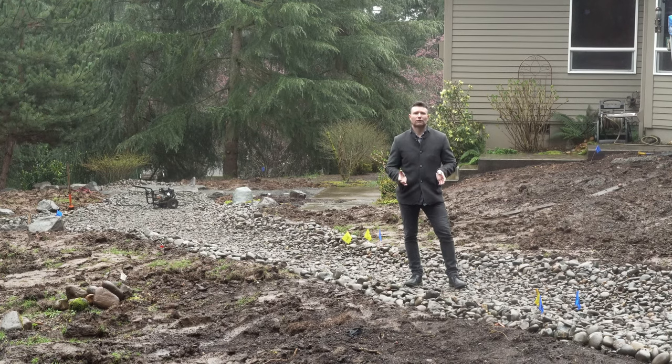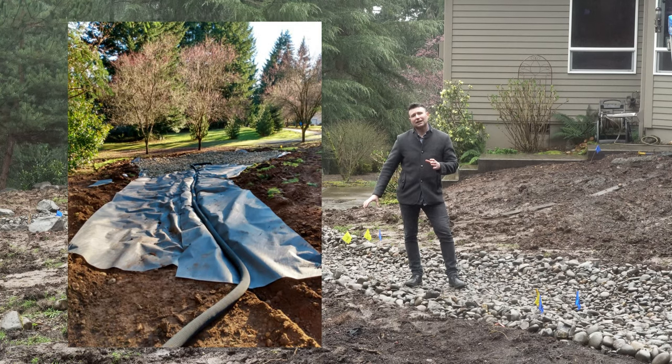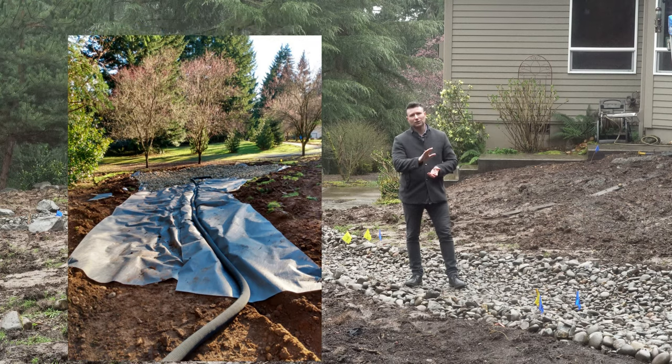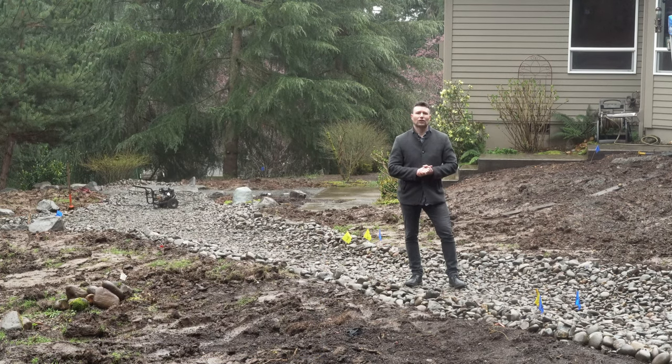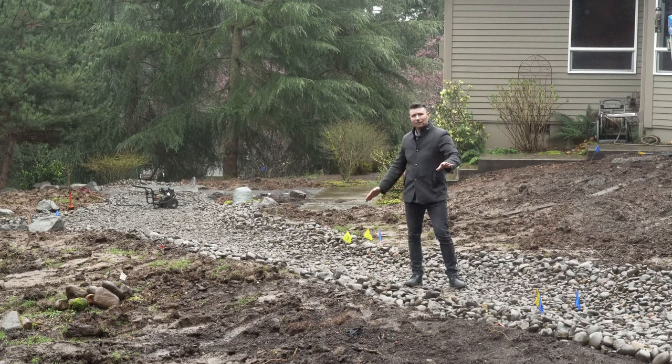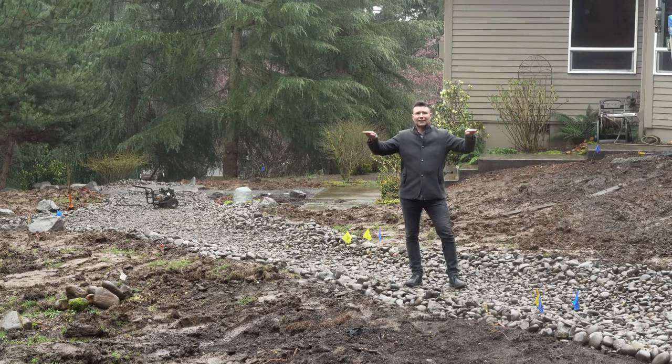Sometimes you use a four inch perforated pipe — I'd recommend putting a sleeve over that. Again, we make it the lowest point, so we excavate and install it at the low point of the drain, with a high side and a low side. It's easy on a sloped landscape, but sometimes you have a very flat area and you still have to establish a high and a low to move water where you want it.